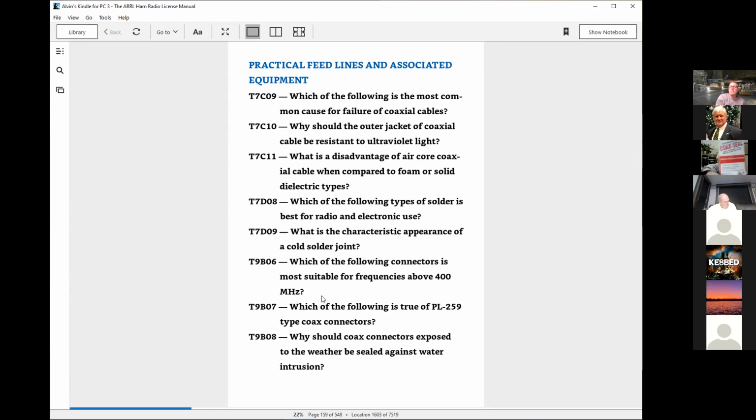I've got this stuff. Where am I? Coax seal. It's kind of a tar-based stuff. And what people usually do is they wrap some electrical tape around the connector first and smear it on. Otherwise, it's very hard to get the gunk off. I'm looking for these things. Oh, here it is. It comes in a roll like this, and you just shape it to seal things off. I put it at the entrance of my house, where the cables come in, and that keeps the varmints out.